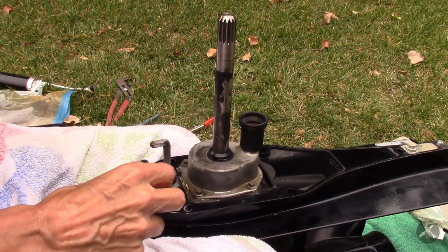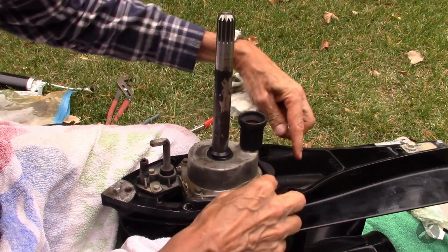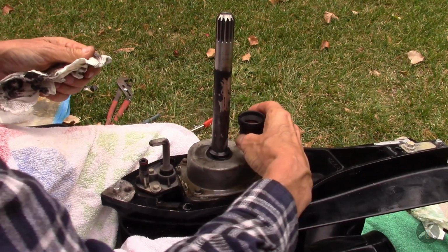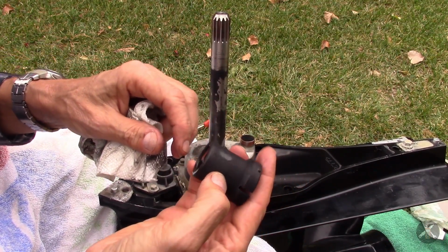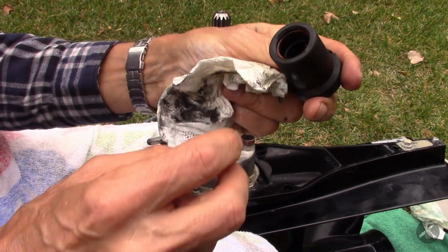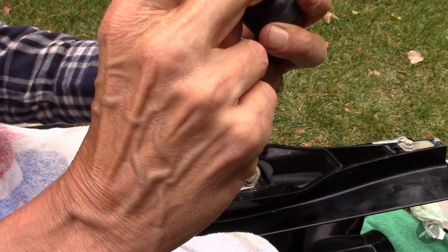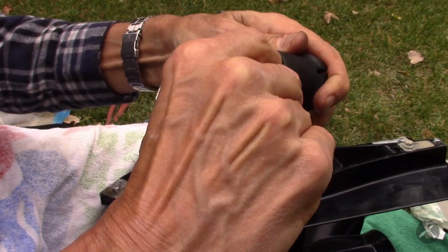And this is the water tube where the output of the water pump feeds upward. And there's a rubber dam back here. Some of the older ones had aluminum, but this one's newer. It's got the rubber style. We can lift this off, and it was installed incorrectly. Look at that. It has an O-ring, and that O-ring has actually been pushed out of position. It was probably mostly sealing, but that's not so good.